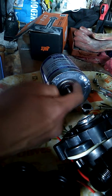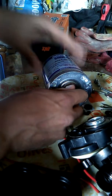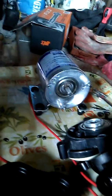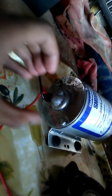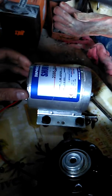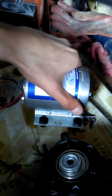Because inside here you've actually got ball bearings, and they connect with the shaft of the motor, and we could feel the rust crunching as we moved it over. But actually what we did is we took out the whole motor, and you can do that yourself by unscrewing here, and you pull out here where you see the connections from the power supply to the motor shaft, and then you can pull out the motor from the bottom. There's another video that shows this complete disassembly, but I'm not going to do it here. It takes a bit of effort to take it out from the bottom because there are big magnets inside which keep holding it in.